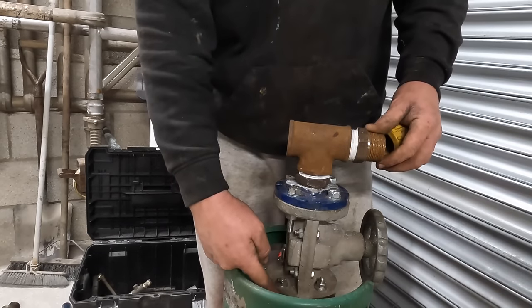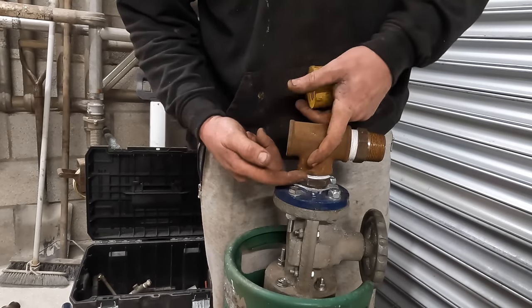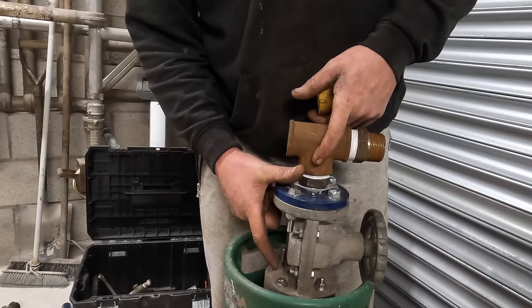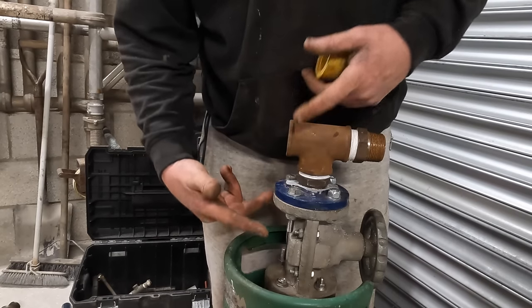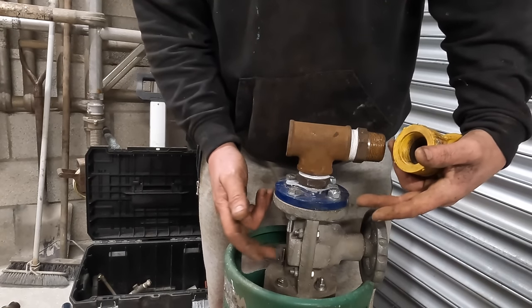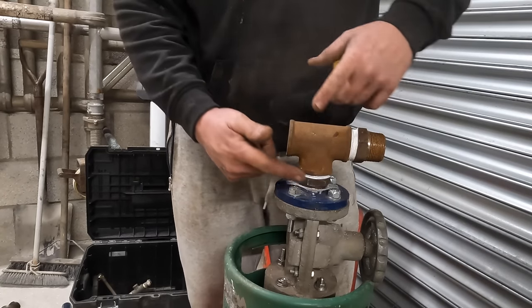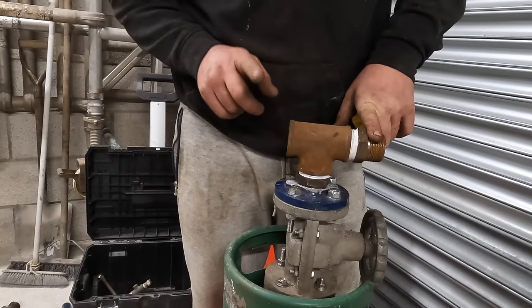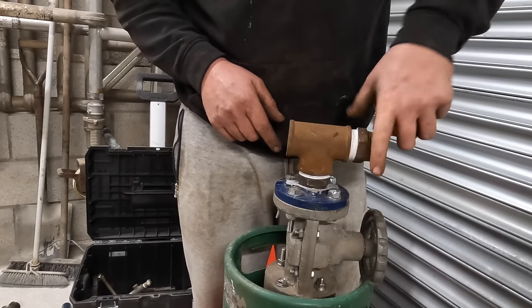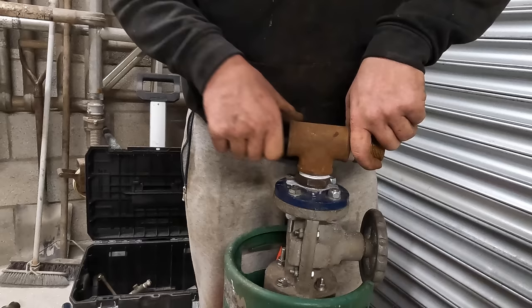So you get your 3/4 barb, and then you've got your bit of pipe, you've got your bit of rubber, your blast pipe coming out, going onto another T-piece with a barb on it. So you'd need 2 barbs, a bit of blast pipe, sandblasting pipe, 2 flat pieces of metal, like plates, to act as that valve. So that's a cheap way of doing it. So then that'd be attached to that, and then that'd be a T-piece with another barb on it, and a barb here. So then you just put your blast hose onto here, and jubilee clip it. And same this side, your air inlet, a barb on here, with a jubilee clip.